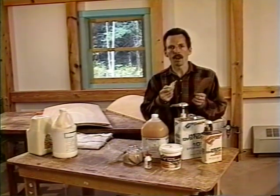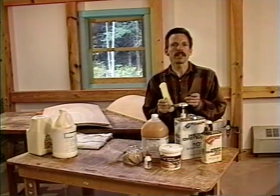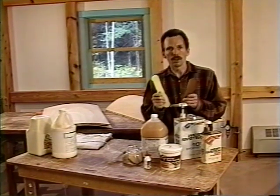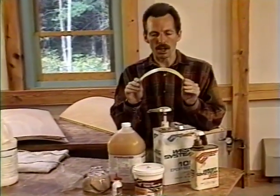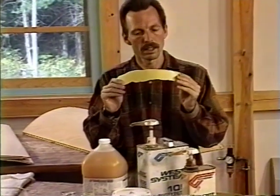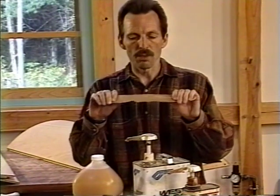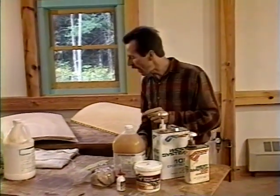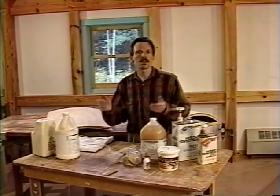I previously poured these out and let them dry completely. If you look at these samples of yellow glue from the PVA family, you will notice that it has some flexibility. This urea resin glue from the rigid group is very hard, even quite brittle. Let's add even a small amount of heat provided by this heating blanket, which would simulate, let's say, a piece of furniture receiving direct sunlight.